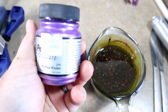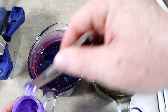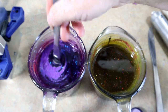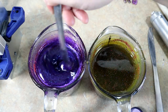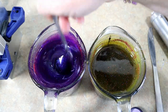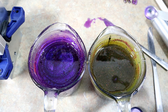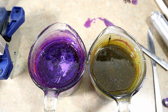The pink-purple side is different - I wonder if I need to thicken it up with some pearl. That's what we're going to do. Hobby Lobby special - just some purple pearl - throwing some in there. Hopefully this doesn't ruin it; all we want to do is change it, not ruin it. It's definitely thickened it. That's what I love about pearls - you can thicken a normal color without changing it too much if you just pearl it up. We need more of it though - it's not quite thick enough.